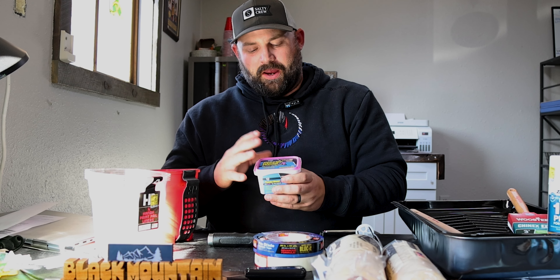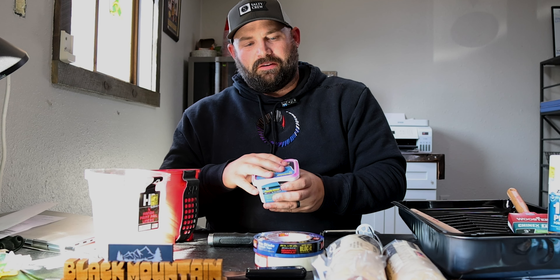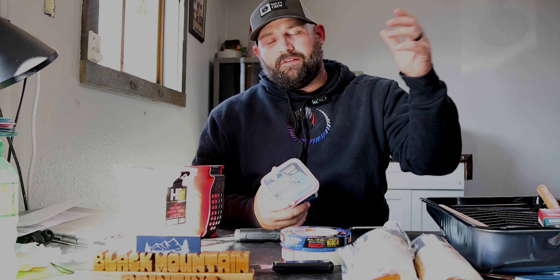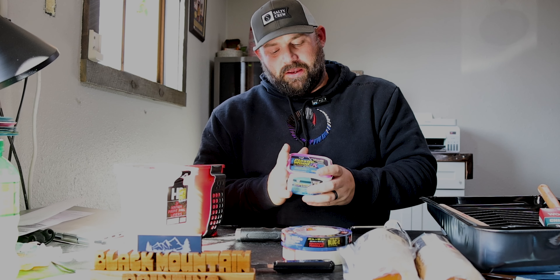This product is also stainable and paintable. When it comes to staining, we do full painting where you put a layer of paint on a wall and then a glaze-stain mixture. The biggest benefit of using a stainable putty is that when we do full walls and rag on a glaze-stain mixture after painting, any holes filled with this product will give you that true stain color.